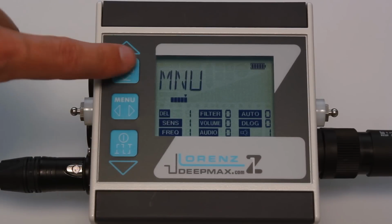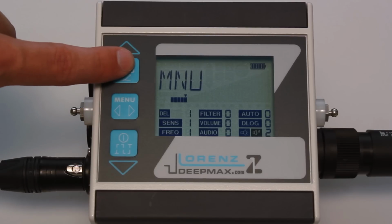Tone provides a range of different audio signals depending on the metal objects. Position 1, a ticking sound with increasing frequency for all metals. Position 2, frequency and threshold increase simultaneously. Position 3 gives a high tone for nuggets and a low tone for all bigger ferrous or non-ferrous metal objects in ground modes 1, 2 or 3.